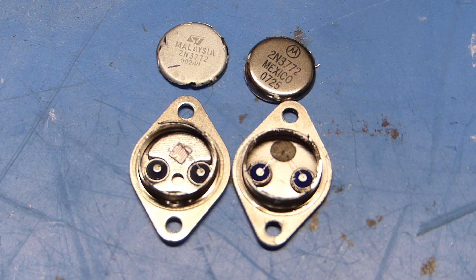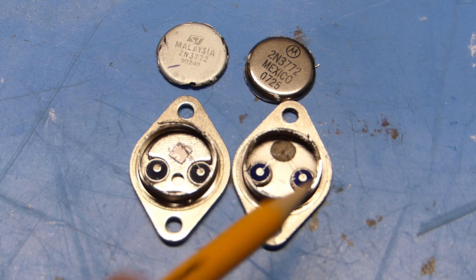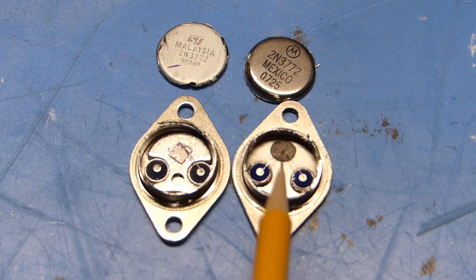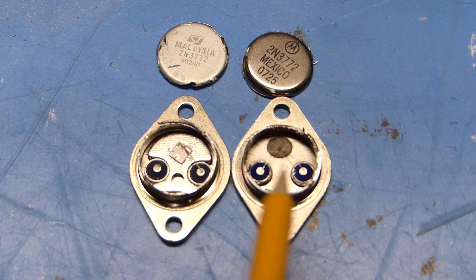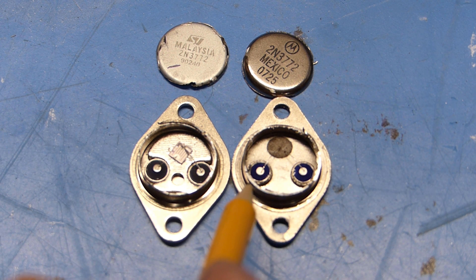Here's a look at the two transistors side by side now that we've got them opened up. This one is the eBay version — the one with just a little tiny blob in it. With the parts oriented as they are, the pin on the right is the emitter, this is the base, and the case is the collector. On the eBay one, the actual transistor material is hidden under this little blob of material, probably some kind of epoxy, and you can see just thin little wires connecting the base and emitter to their respective terminals. That's all that's going on — it's mounted directly to the base plate.